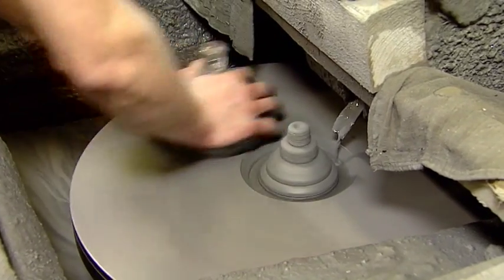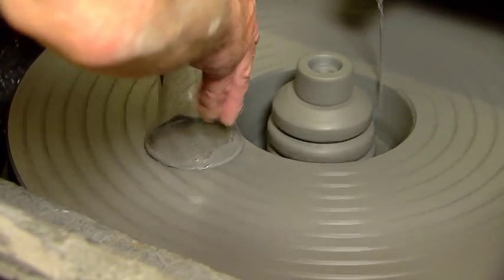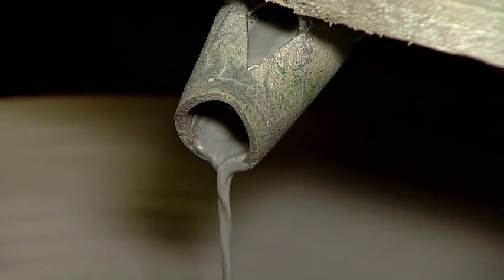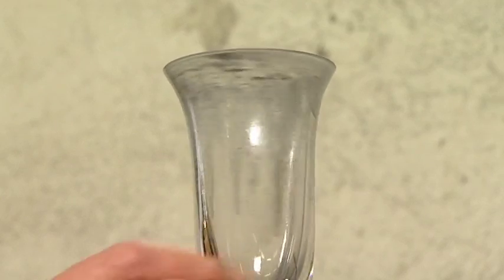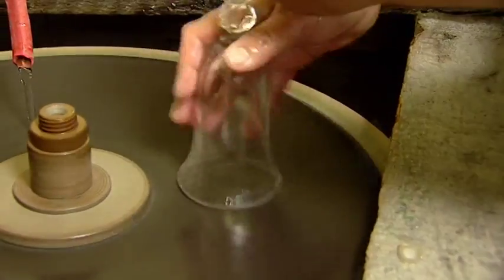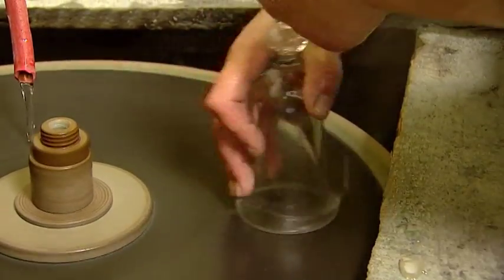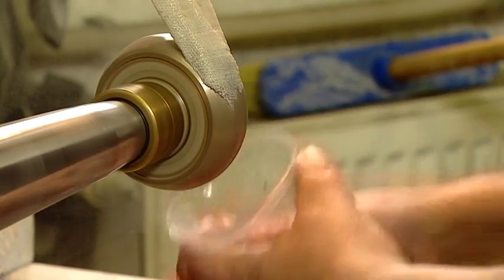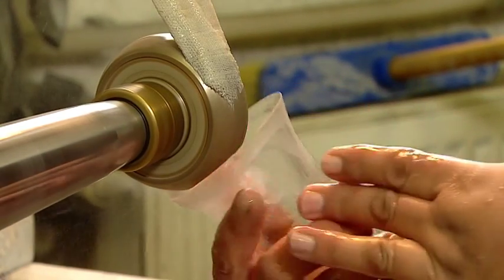Scheibe is a horizontal disc grinder. The disc is made of cast iron and silicon carbide onto which flows an abrasive of varied roughness. The grinder is used for evening, smoothing, and grinding the bottoms and tops of glasses. Water is used to cool the product off, and water also takes away the material which was ground off.